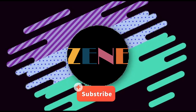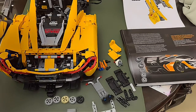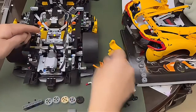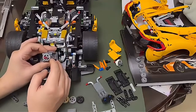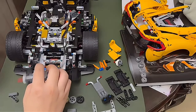First, let's look at the 20T gear beating issue. Some customers complain that after finishing the re-modification, they find a lot of noise from the gears. So let's take off the cover to find the cause. We remove the left arm and take out the motor — the noise comes from this gear. I was wondering why some customers are fine but some got this issue, so I checked the diameter of the gears.